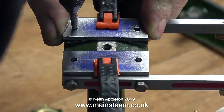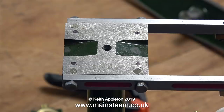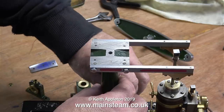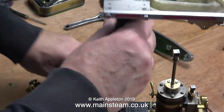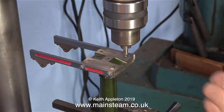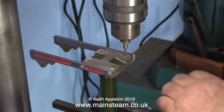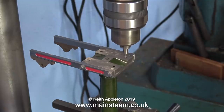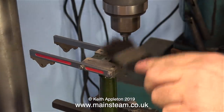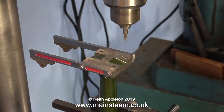Here's a close-up showing I've drilled the holes in the two pieces of steel plate. I marked the position of the holes on the top of the column using the special pen, and here I'm using a spring-loaded centre punch to make sure the holes are in the right place — and indeed they are. I could have used a transfer punch but I find those a bit cumbersome. Over now to the drilling machine for the important part: drilling the holes in the centre of the column, which is made up of plugged holes and cast iron. Even with centre punch marks I'm still using a centre drill to get these holes very accurate, as it's far less likely to wander between the two metals — steel and cast iron — than a standard twist drill would.